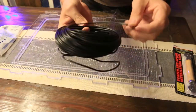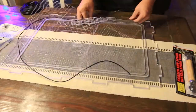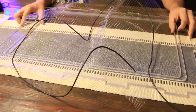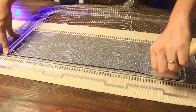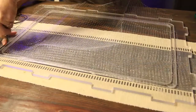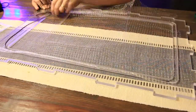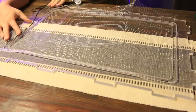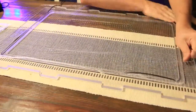Once I had that cut to the right size, it was time to put the spline on. When measuring the spline, you want to make sure you get it all the way around the perimeter of your frame and give a little bit of excess once you reach the end, because you can always trim that off later. The challenging part is when you're actually using the spline tool to hold your screen in place — it's a challenge to keep the screen as tight as possible so that it's not loose once you get it in the grooves. You just use the spline tool to push the spline into the groove cut into the plexi.